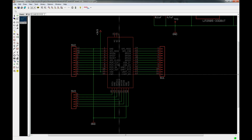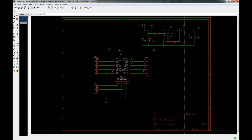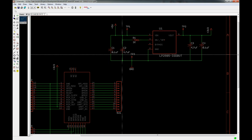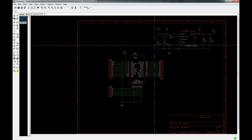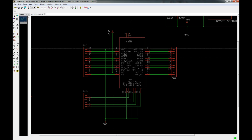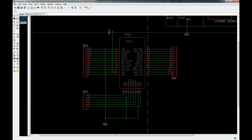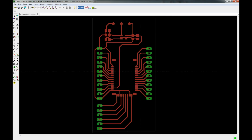What I did was go ahead and in Eagle CAD draw up basically a testing board. I put a voltage regulator down — I think it's an SOT-23 package — and put down all the necessary components to build a regulator. Honestly I think I just hooked it up straight to a power supply set to 3.3 volts, but the main thing is I took the chip, made a footprint for it, and brought it out to some headers so I could make it like a plug-in device where you can plug it into a breadboard.